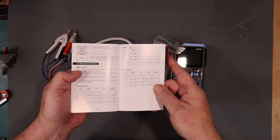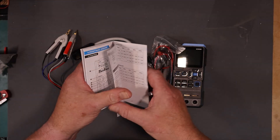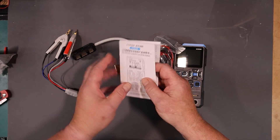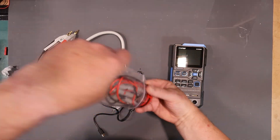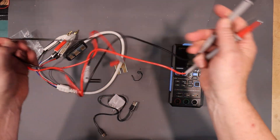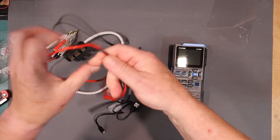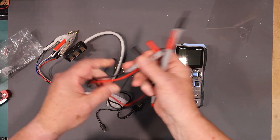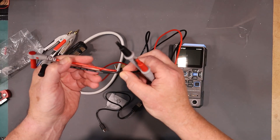Here are the general parameters and the measurement accuracy. I haven't done anything with this and know nothing about it, so this is going to be a very investigative look at this meter. Let's have a look at these probes. They're not bad — they feel about like what you get on Fluke leads, not the really expensive silicone ones, but the ones they give you with the meter. They do have ratings on them: 20 AWG, 2000 volts, 80 degrees C.